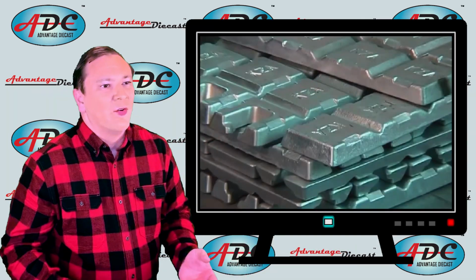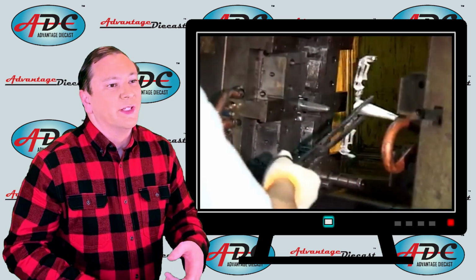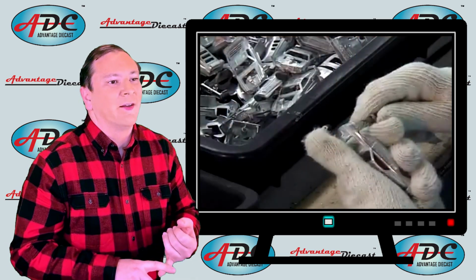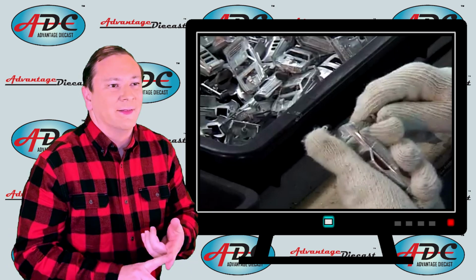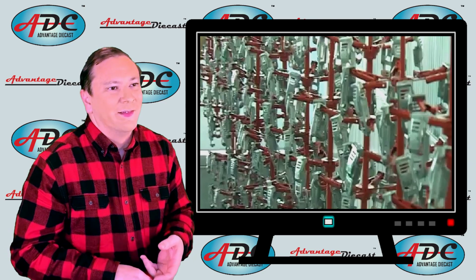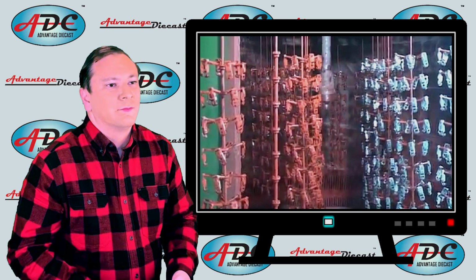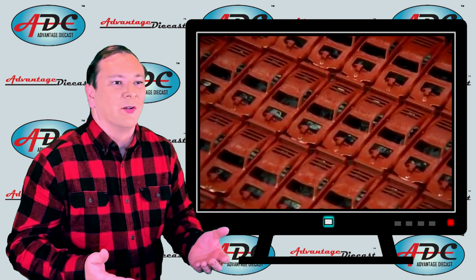So far in the series, we have gone from the raw metal all the way up to our diecast parts using a high-pressure diecast injection machine. The castings are cut off of the sprue and they are cleaned. Then the sharp edges are removed and they're ready for paint. Next, the parts are hung on a tree for painting. They're painted either with an airbrush or a powder-coated painting in a paint booth. This gives us a nice painted finish on our metal parts.